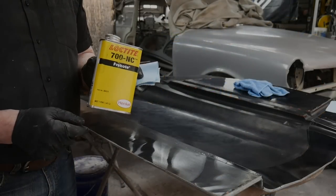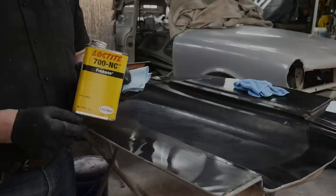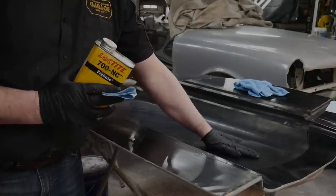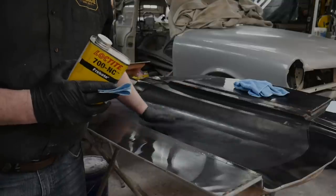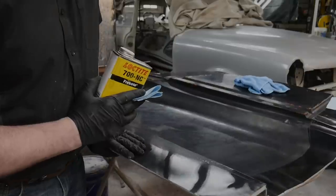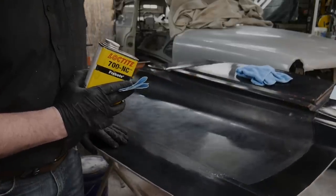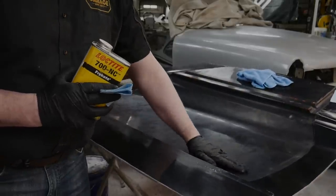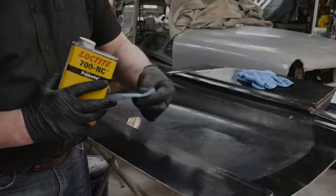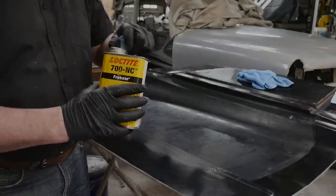I've already sealed this mold so I don't need to go over that step. You can see I've wet sanded the mold — in this case taken it to 1000 grit wet. I didn't really see any need to go further than that, and as it's a black gel coat surface it's reasonably difficult to pick up on camera, so I'm doing the best I can to show you all the details.